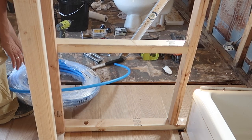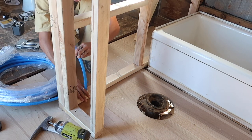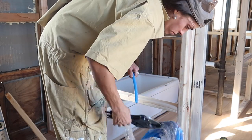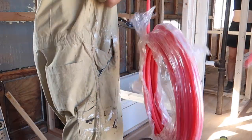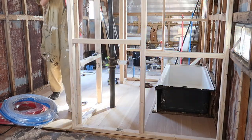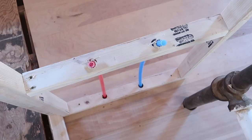Plumbing throughout the trailer used to be all PVC. You do not want hot water running through PVC, so I am replacing everything with PEX, which I've never worked with — but after looking it up it seems fairly easy. People have different recommendations: crimp it, don't use the push-and-plug connections. That all sounded a little overwhelming, so my main focus was to put the cold water where it was supposed to go and the hot water where it was supposed to go. I decided to leave the existing plumbing where it was because the cast iron situation definitely freaked me out.